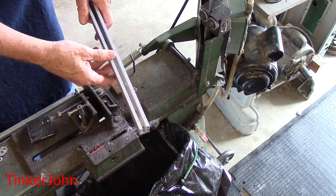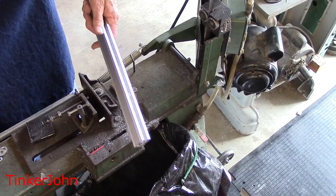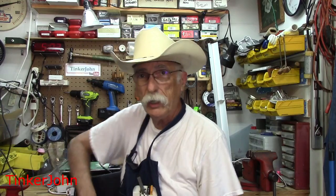So now I've got a few more things I got to do to it, but I'm pleased. I got to go cut the other one off also — so that's one down, one to go. That was kind of a surprise that they cut as well as they did. I went ahead and got the other axis, the shorter one, and cut it — had no problems with it. Actually, the one I was most concerned with was re-tapping the ends to where it goes on the DRO. Here are the two pieces that I cut off, and that's some pretty tough aluminum — a pretty tough extrusion.